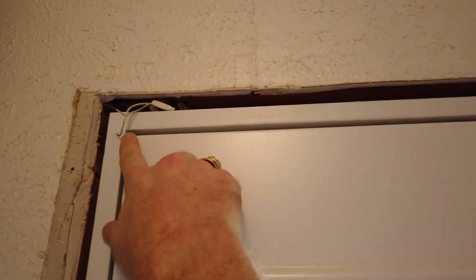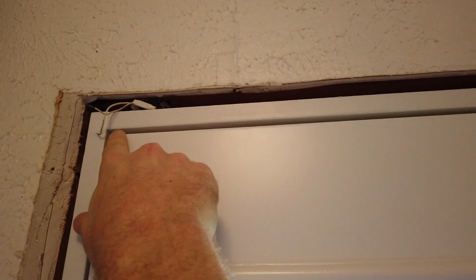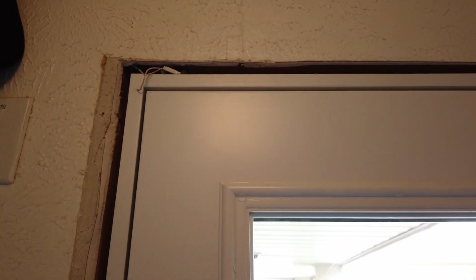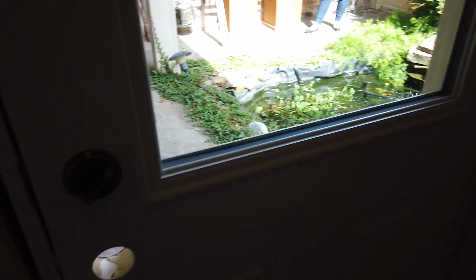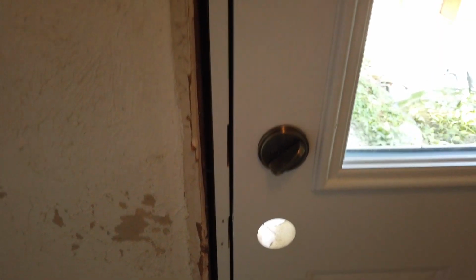But that's one thing whenever I go to a customer's home that's interested in replacing their door, or they complain about their door that's not operating properly, an existing door, not necessarily one that we've installed. One of the first things I'll look at, usually starting in the corner, is the reveal gap. I'm talking about this gap here, and you go from one side to the other, and then look from top to bottom. A properly set door, that reveal gap should be even the entire way across the door and from top to bottom. It's a very easy thing to diagnose and see, and that's the first thing I'll look at. If the reveal gap's not right, it's pretty easy to say that they're going to need to at the very least reset their door.